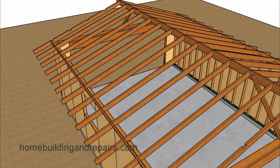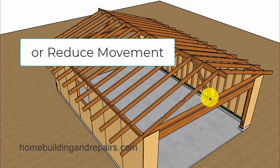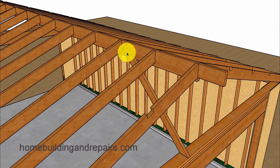Next, let's install the two-by-six roof rafters spaced 24 inches on center. If you are dealing with snow loads, you might need to space the rafters closer together — maybe 16 inches on center — and use larger rafters. We will have notches for our lookouts, blocking, and a brace at each side. This brace works two ways: it prevents the ridge from moving, and after the roof sheathing is installed it prevents the wall from moving as well.